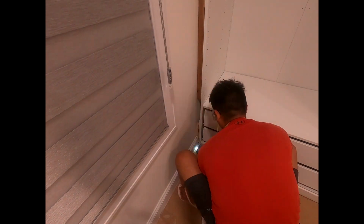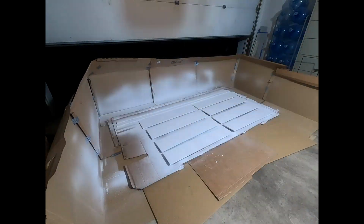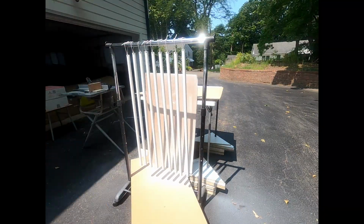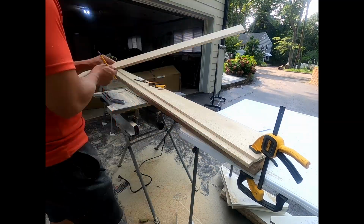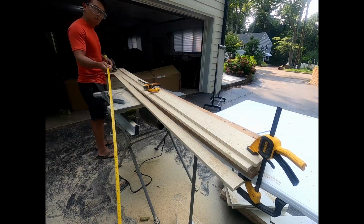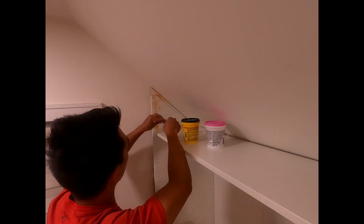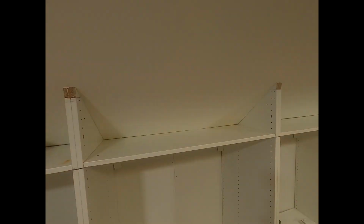I had to cut out the baseboards there to make room for what you'll see goes in there later. But basically, the baseboard trim is gonna insert into the original baseboard. A track saw would have been really helpful, but instead I had to resort to just throwing up a 2x4 as my track, and had to just anchor everything down in place.